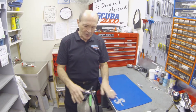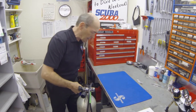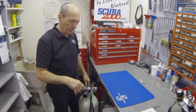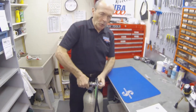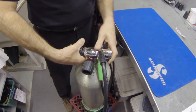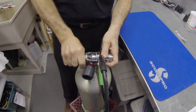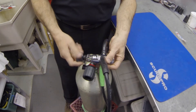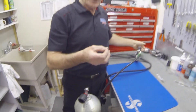Let me show you another little tip. This tank is still under pressure — if you look at the pressure gauge, I can see it's still under pressure. I have not purged the regulator yet. Yep, still air in there. Now, you know this is wrong, but watch. If you slowly but surely open that tank knob and let a bit more air out, and now you turn that knob — turn it slowly, very very slowly — the O-ring falls out. There it is, right by your foot. Don't lose it if you're on a dive boat or on a dock — try to catch it before it lands on the floor. There's the O-ring, that bad O-ring that is trying to stop us from going scuba diving.